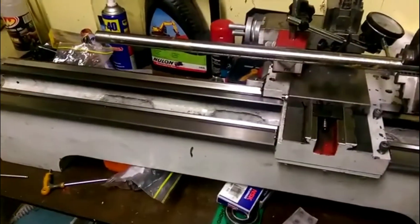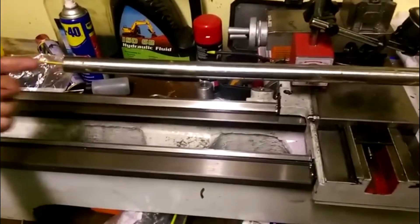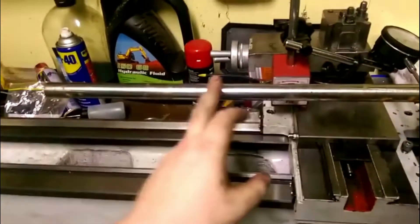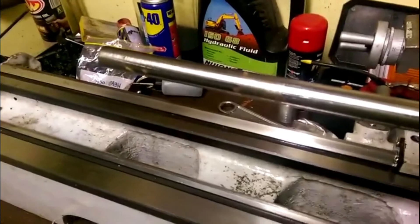On my machine, if I'm working this far out from the headstock — which is about 400 millimeters — I've got the tailstock in. So getting it tuned this closely doesn't really matter at that distance. You probably want to be testing closer up here perhaps. I'm relatively pleased with the results — I'm one thou out over 400 millimeters.